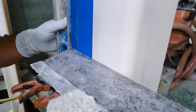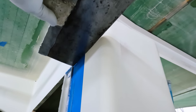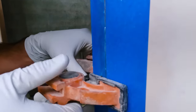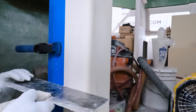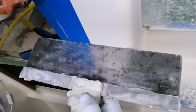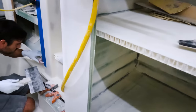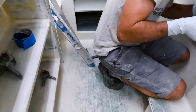The delicate part is making sure this is actually level and flush with the edge. If you look underneath, the wood is sitting proud of that edge, so I've got to get that piece pushed in and down. Down here it's nice and tight, and that is the goal — to have it match. Clamps, clamps, clamps — we can never have enough clamps. There's no such thing as too many clamps, definitely not on a boat build.